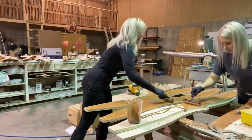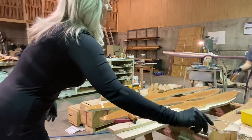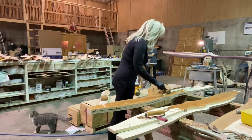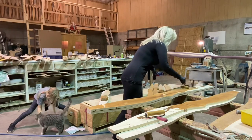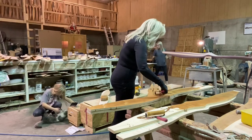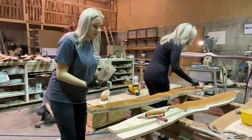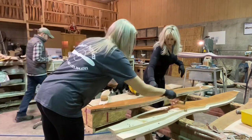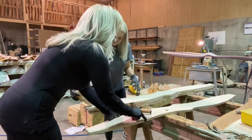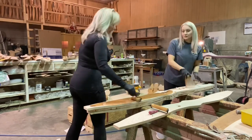The little hole she drilled earlier — we take a clothes hanger wire and stick it through to center all the boards, then clamp each end. For this one, because it is so thick, I'll pin it with dowel rods: I drill a hole at each end way past the actual diameter of the prop so it's never part of the finished prop. For smaller two- or three-board props I just put little bitty nails in the end — it's quicker and easier than drilling the dowel rods.